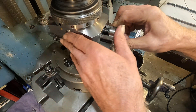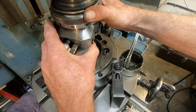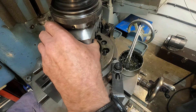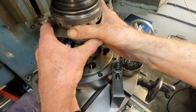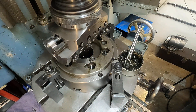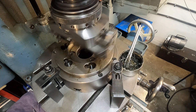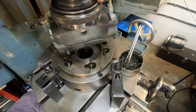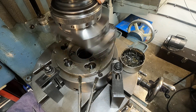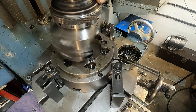I'm going to get that pretty close. Got it ready, got the depth — 3½ thousandths. RPM is 205. I'm going to run it quite slow. Get it in gear. Fire in the hole. We'll see if it chatters or anything. I put some lube on it, of course. Okay, it's starting to cut.